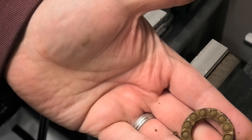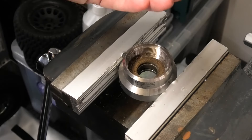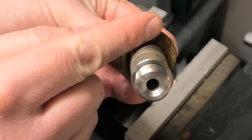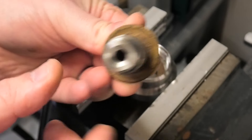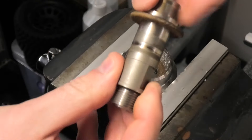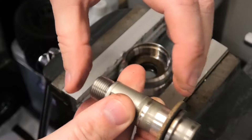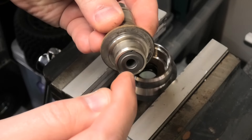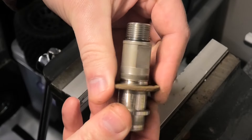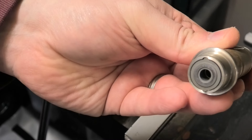The bearing and bearing cage are rusted to hell. They don't seem to be stainless steel, which is very unusual considering these are used in water at high pressure and high speeds. Once they start corroding, the gunk and rust chips away and could potentially block the inside. You can see it's really corroded and pitted — that's what was giving the very notchy effect, making the whole assembly grouchy. Basically you're going to want to knock that piece off. Pop it into a vice, taking extra care of that carbide seat, and just tap gently on the other end with a soft-face mallet — it should come out quite easily.